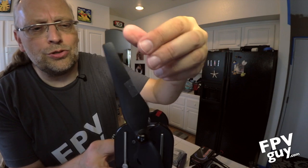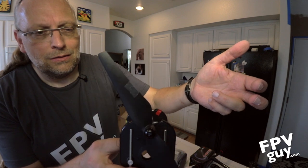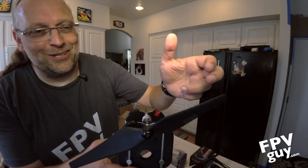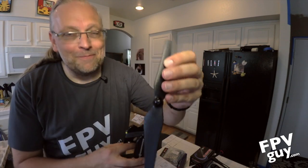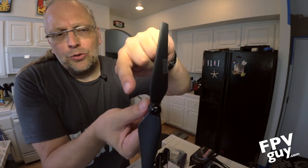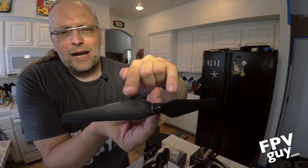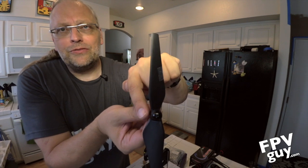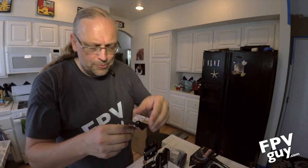So I have some tape ready and I'm just going to use a little piece of tape — about this much. What we're going to do is put it on the side of the propeller that came up. So we're just going to put it on here, kind of halfway on the leading edge of the propeller. I moved the tape further out, and now when we put it down here, it's basically balanced now. So that's close enough. If it was still moving when you have it vertical, you want to put a piece of thick tape on the side of the hub. So first you balance it this way, then you turn it vertical and put a piece of tape on the hub to get the straight balance. Then the propeller is ready to go.